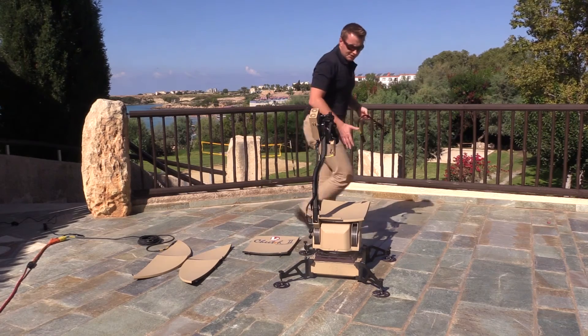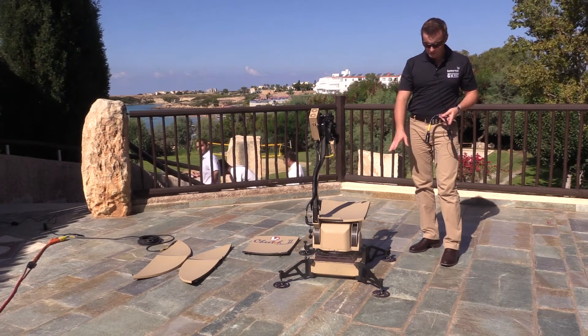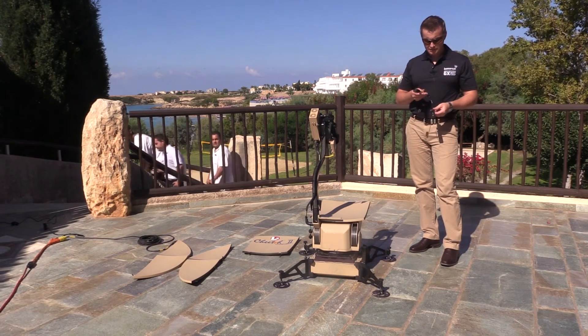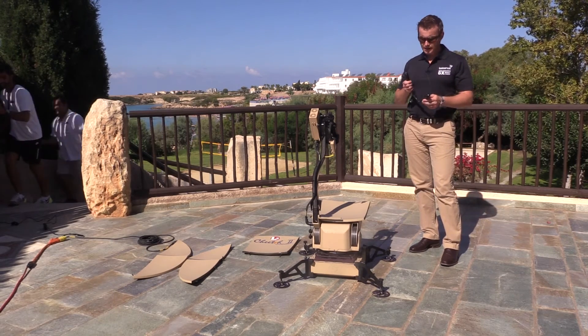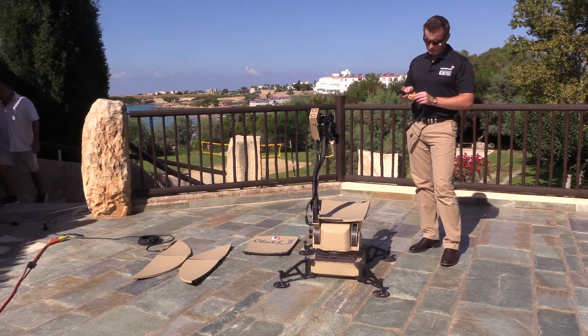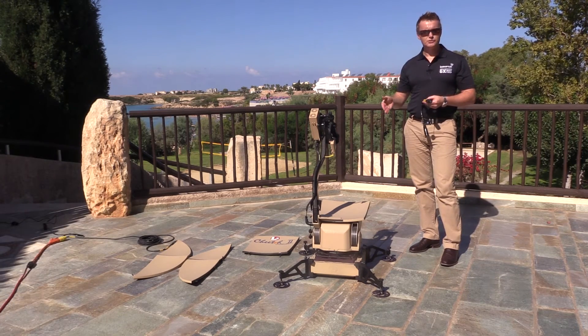Between the chassis and the pedestal, again, there's only a single cable that attaches the two units together. The main thing to know: this gets placed in the J3 connector, and the part of the cable with the yellow indicator on it actually gets attached to the pedestal unit.